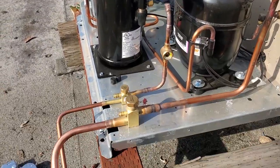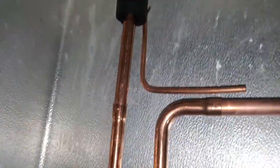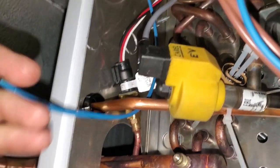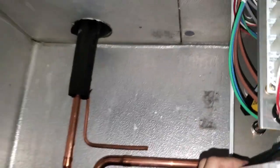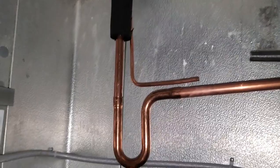We get this far and then we go to test to see if there's nitrogen. Inside the box, we got a line set coming down, we got a P-trap, we're going into the coil, and we just got to cut off that three-eighths connector and go into that. Very important when you're doing these QRC or beacon units — you've got to remove the suction line temp sensor or you'll melt it. So we remove it. We're going to energize the coil, get the TXV opened up, and then we'll purge nitrogen and braze.